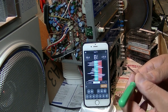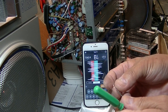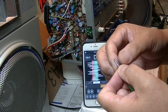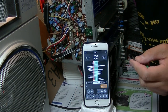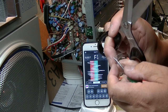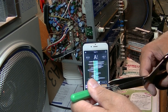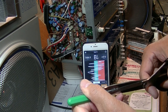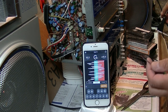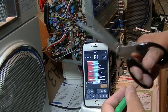And using the scotch tape on top of it. Let's use this one. Like this. This will prevent a short inside of the motor speed module. So the best one is not the steel one, the plastic one, if you have it. That's the best one, but if you don't have it, you want to cover here like this and cut.